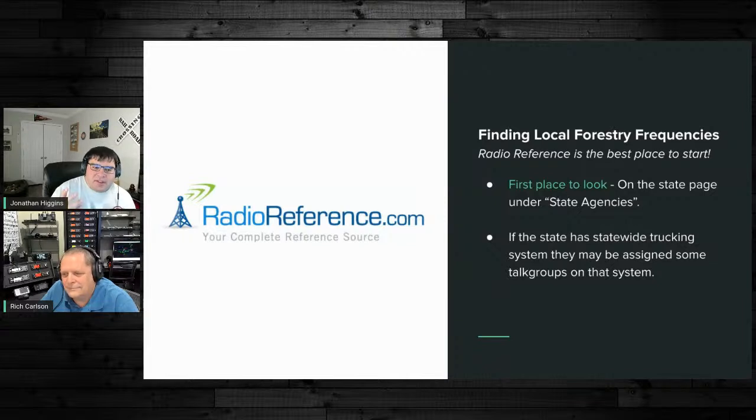Of course, the best place to look for these frequencies is Radio Reference. A lot of the time, the forestry services will be listed on the state page under state agencies. So don't go too far when you go to your state. When you're on the state page, look below the map of the state, and you'll see state agencies, and you should find some frequencies locally.